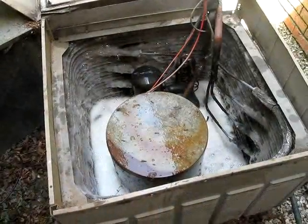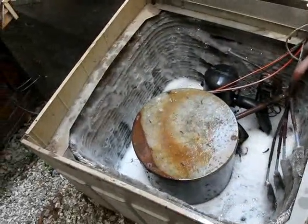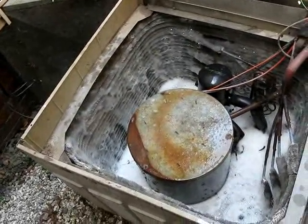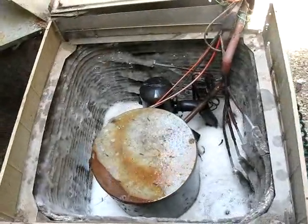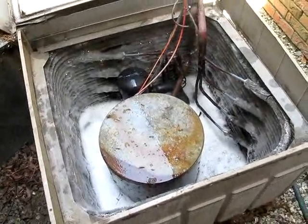I had to give it a few minutes to set up. Then you put them together and they form a good bond — hopefully it won't go flying off and get sucked into the blower motor. Alright, we have our GE Weathertron condenser and coil cleaner. I'm going to let it sit here for a few minutes and then spray it out. Then we can put everything back together and start the unit up and make sure everything's going to speed.